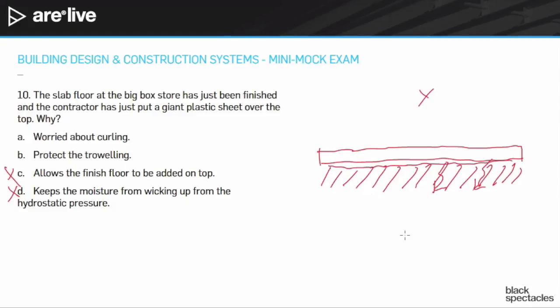This isn't always the case — there are situations where the ground is very porous and pulls moisture out, and the humidity level is very high. But in general, for big box stores, they're really worried about this differential. They want it all to go through the heat of hydration — the chemical process of water bonding to the cement — at a continuous level all the way across. Because if the top dries out fast, you're very likely to get a little bit of curl at those edges, and that slab is going to curl up.